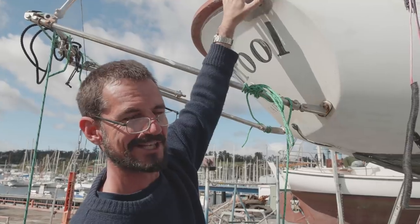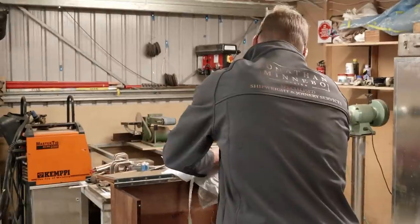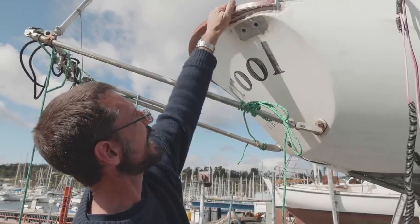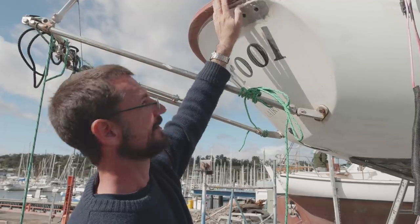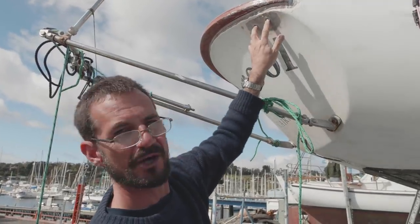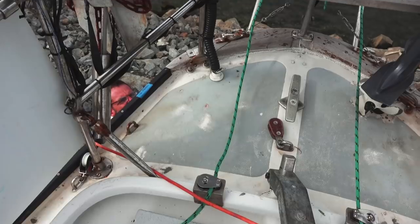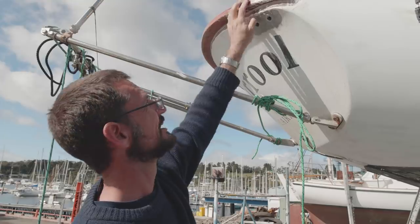So we've got a new transom cap. It's actually made out of West Australian Jarrah, which is a pretty solid hardwood. There's a furniture maker and shipwright here, Jonathan Minabo, and he offered us space in his workshop as well — which is incredibly generous — and he whipped this up for us really quickly. We've got this hardwood transom cap and I'm going to glass this in and we'll probably just paint it black. We're not going to leave it natural timber because it was just some offcuts put together. I've glued this in with thickened epoxy, got a reasonably nice fillet here. We'll smooth all of this and make a nice transition into our holes for our Dyneema chain plates that are going to go for the backstays. We'll fair all of this — you'll hardly recognize it — and I am going to glass this into the boat as well. I'm pretty happy to get rid of that old transom cap, which was basically just there to support the arch that holds our wind generator and our solar panels. This will be a much stronger addition.